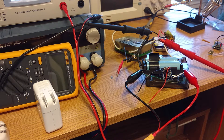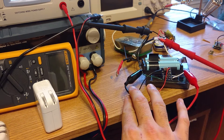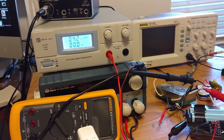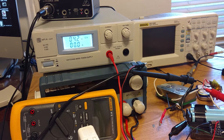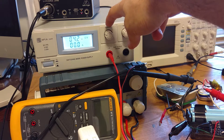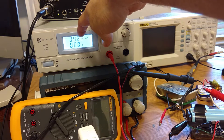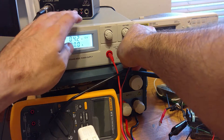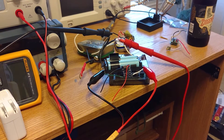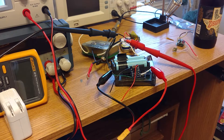I have a lot of stuff going on here. The big things you need to be concerned with are my batteries in my battery tray and these two clips right here. These are connected directly to the contacts in the battery tray. Up here is our power supply — I have it set to 4.2 volts and the current limited to two amps. These batteries are fairly well discharged. So once I plug this in, that voltage is going to drop to just above battery voltage. No smoke, no mirrors — everything's fine. This is how it works, ladies and gents.